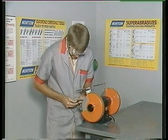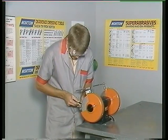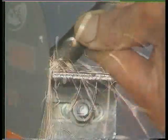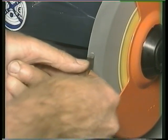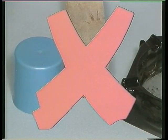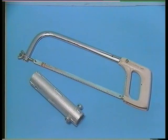We have now described some practical uses of a bench grinder. Let's now review some basic but important rules. Firstly, you should never exert such pressure against a wheel that will cause the spindle speed to drop. Never jab or bump the work against a wheel. Always apply the work gently. Never grind such materials as wood, plastic or glass on a grindstone. Avoid grinding such metals as copper, brass or aluminium, as these will clog wheels rapidly. It is recommended that softer materials be filed or cut with a hacksaw.